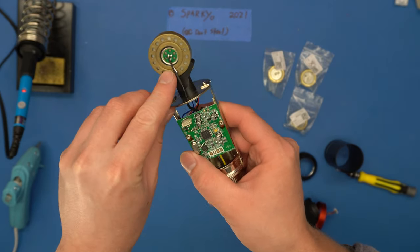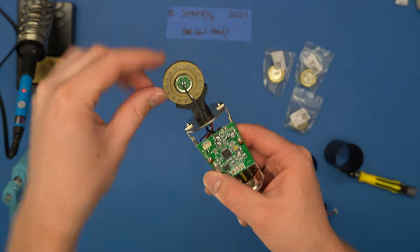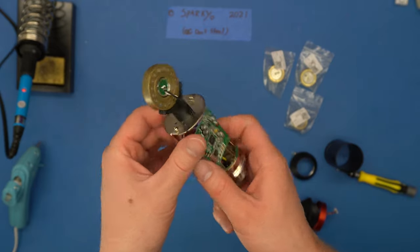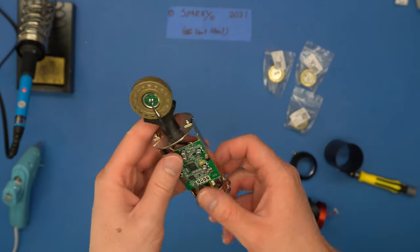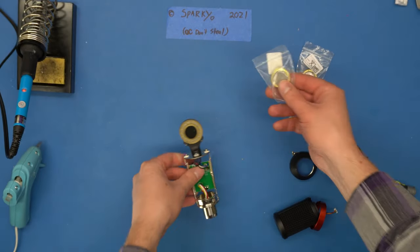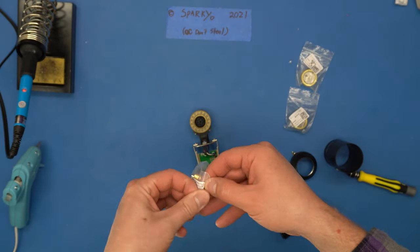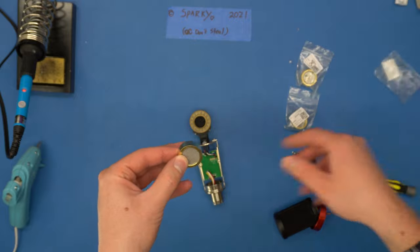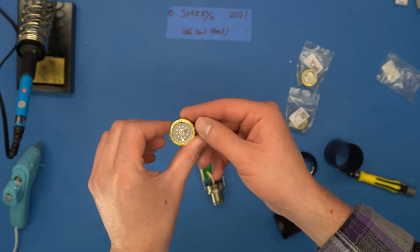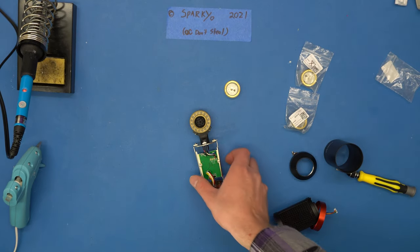So this is what I was talking about — you have this big plastic ring the size of a large condenser, 34 millimeters across, but right here in the middle is the actual condenser, which is 14 millimeters. What we're going to do is replace this whole thing with one of these 25 millimeter condensers. I got them from AliExpress — I bought three for $12 shipped, so $4 each. Pricing varies, and you can probably find something similar on Amazon, but it'll usually cost a bit more.